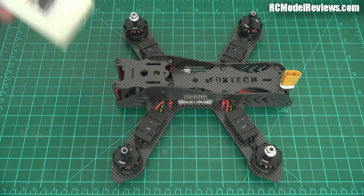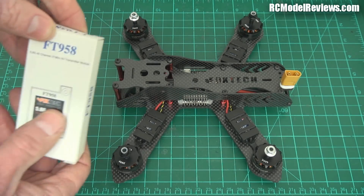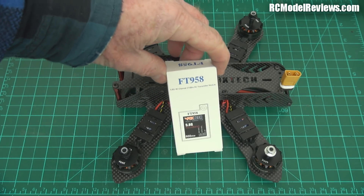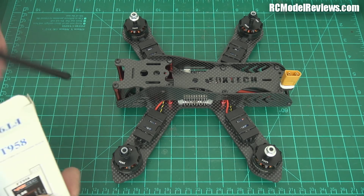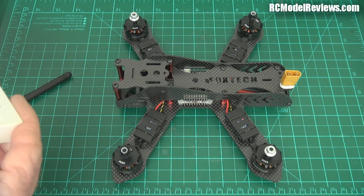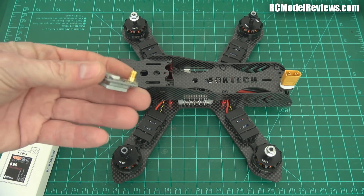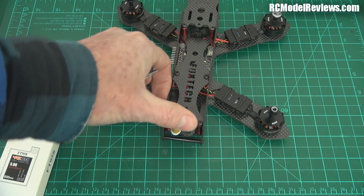It also came with a video transmitter — it's a 600mW transmitter. 600mW is really good if you're flying on your own or doing freestyle, but not so much for racing. Some racing events don't like you to use high power levels because you can stomp on nearby frequencies, so if you're going racing you might want to buy a 25mW transmitter. The other thing I noticed is that this transmitter unfortunately just doesn't seem to fit the frame very well. It's a fine transmitter, but for a start it's got a right-angled SMA connector.